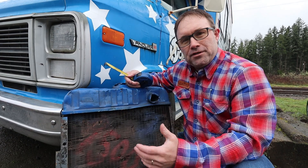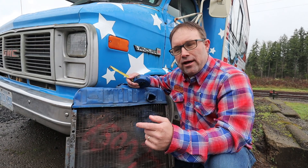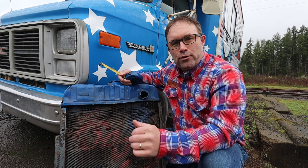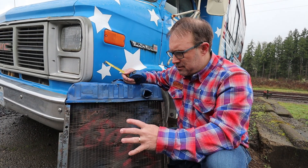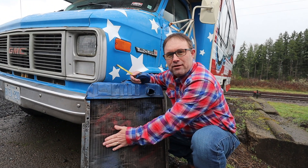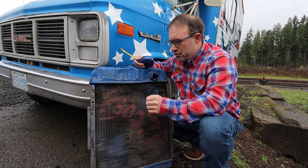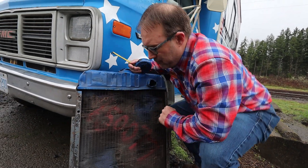So what is the value of fins per inch? Something with high fins per inch is used on the highway — maybe a semi truck, something you'd see in your Honda car or Chevy pickup. If you're going out into the field where you have debris — agriculture, logging, dairy, farming — you're going to want to open those fins up. If the fins are plugged, it doesn't matter how many fins you have; you're not going to get dissipation of heat. So it's very important to match fins per inch to the application.